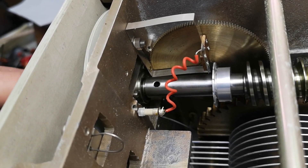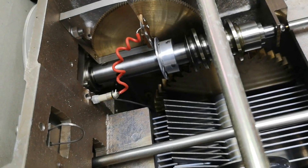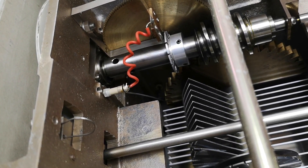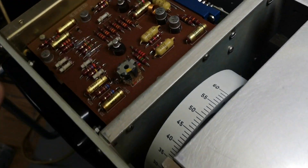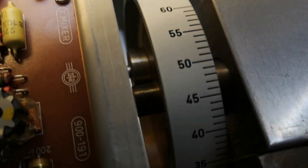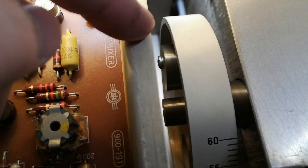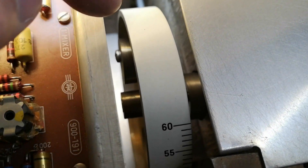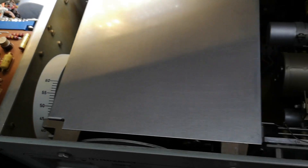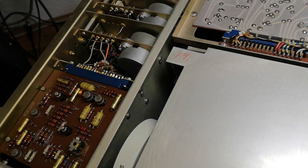Note this thing - it's not touching. This is actually a marker, so when you're doing sweeps you can set markers. And since this is in balance there will be a weight difference, so you can just let it go and it will stay there. What they've done is added a brass counterweight to this wheel to compensate. If you release the screw you can turn this because the hole is not in the middle, and then you can fine tune by rotating for perfect balance when dialing around. Just those cool cool things.